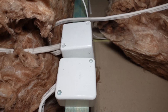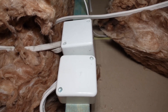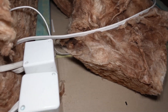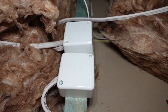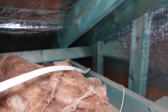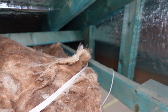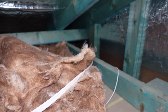Apparently it was actually legal to splice that aircon into the existing powerpoint, even though I've only got two circuits for the entire house. Apparently it is legal - please leave it in the comments down below if that's not right. Apparently it is legal to actually wire it into the existing house wiring if it's under a certain rating, and it was. Anyway, they've now installed the additional circuit breaker and a dedicated line for this aircon, which just runs off down there somewhere. Here it is - pops out. The reason they spliced into the existing circuit is because the existing wire is right here - they don't have to crawl through the roof running cable. It's cheaper because they don't have to run cable from the box, which is on the opposite corner of the house - probably a 30 metre run or something like that. Let's just splice it into that - no worries, it's legal. But oops, they forgot the isolation box.